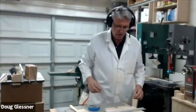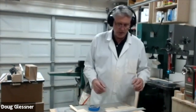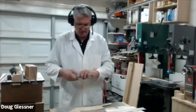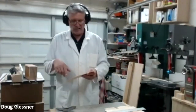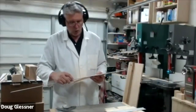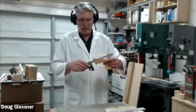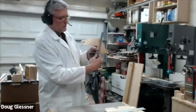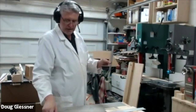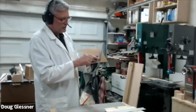How did you make sure they were actually square so all the abutting surfaces are flush? I used a square to square off the end. I took the piece and scribed it straight with my ruler — I have a 36-inch ruler and scribed a straight line all the way across. Then I butted my square up against that. Then I took my scalpel and scribed from one reference to the other, giving me two square references — one on this edge and one here.